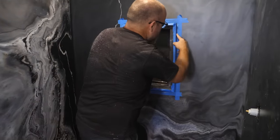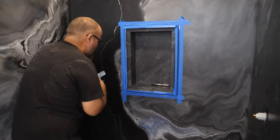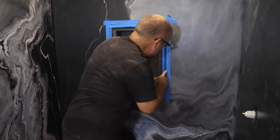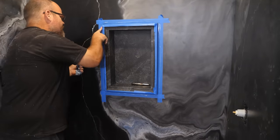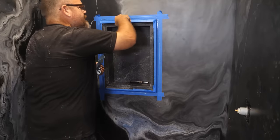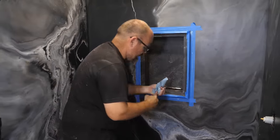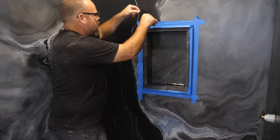You know, why aren't we using a color here? Because color sometimes, in caulking, will draw your eye to it. Like white will look like toothpaste. Black will look really shiny sometimes, so the clearer you almost lose it. And so if you have nice tight joints that don't need to be colored, that's the way to go. And you don't want to over tool this, but I'm getting anything excess out so that when I peel the tape I don't have a sharp line.